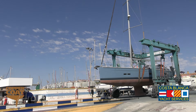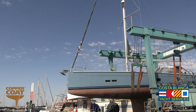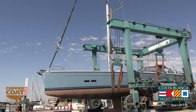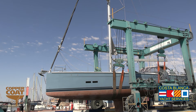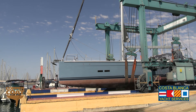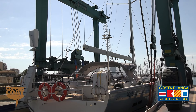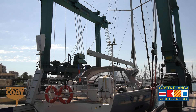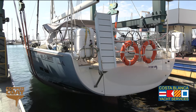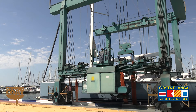The boat is relaunched. The first thing we do is check any work that we've done on the boat which involves sea cocks or entrances into the boat under the waterline. We always check those when the boat goes in the water while it's still suspended, to make sure there are no problems or errors. We do have a 99% success rate with fitting sea cocks, so we really don't have too much to worry about.